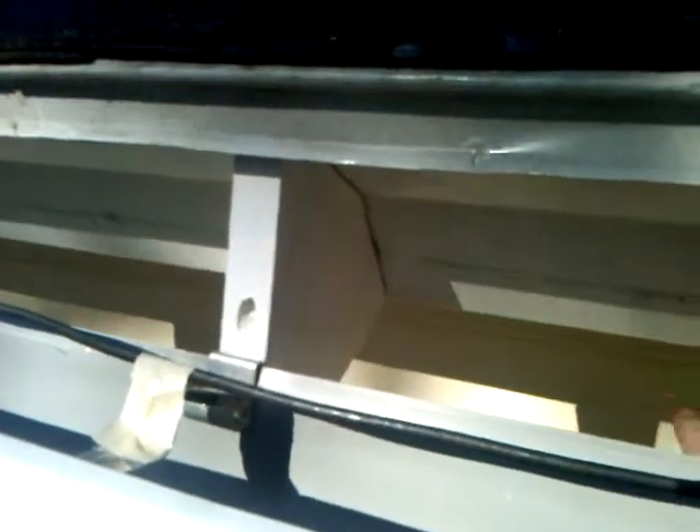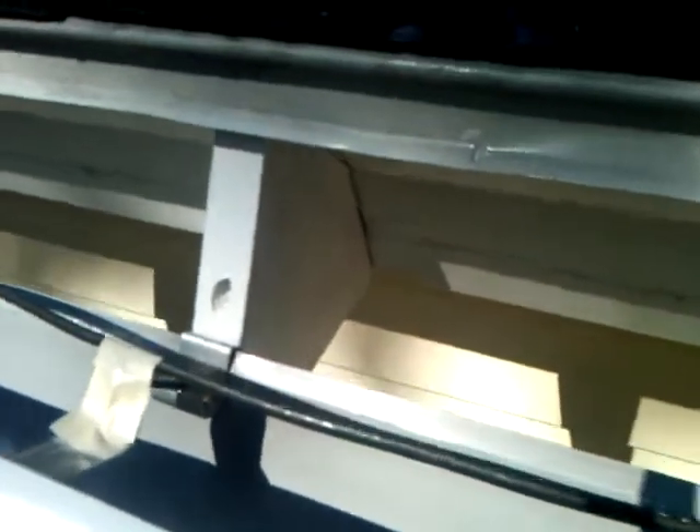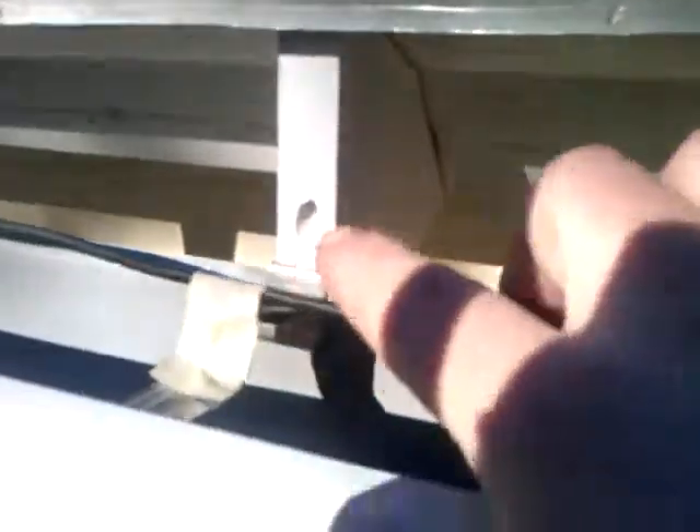I have my fancy little brackets here — these are all custom made. I made those because I needed it to stand off from the fascia. It's got this weird double angle, actually some fancy looking trim underneath which they cut off with this ugly looking metal. It's three times the length of the gutter and double run into the downspout. I over-drilled the holes going into the hangers so it will shift side to side because we have expansion issues.